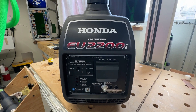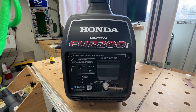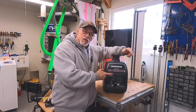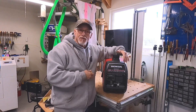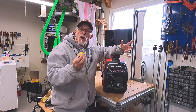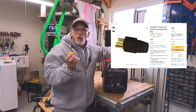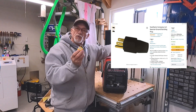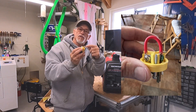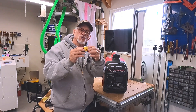So what it is is very simple. We're going to look at a grounding bond plug — what it looks like and what it does. Once you've identified that your generator has a floating neutral, like most all Hondas and several other inverter type generators, you're going to want to get yourself a neutral ground bonding plug. You can order them on Amazon. They're real simple to either make or you can buy one — anywhere from 12 to 15 bucks. The only thing this plug is doing is it's tying together the neutral and the ground. There's a jumper wire inside this plug, and I'll show you a picture for reference where they've wired the neutral and the ground together.